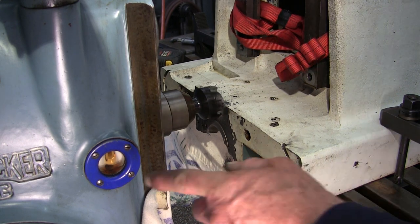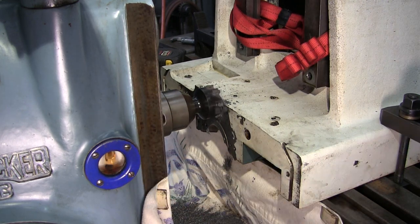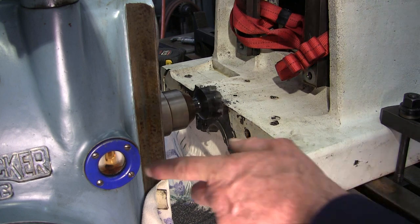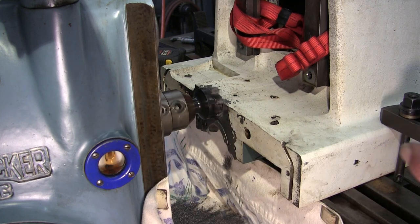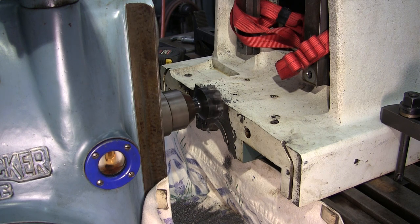I get asked a lot about my sight gauge here on the side of the mill. This is to let you know it's flowing. The lower one actually tells you the limit. So sometimes you'll see the spindle stopped or the motor stopped and no oil flowing out of there, and that's why.